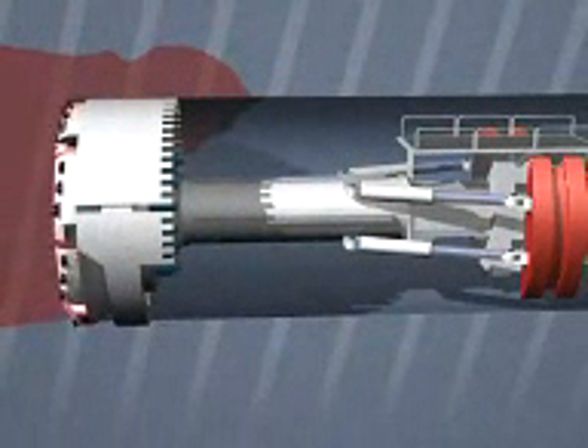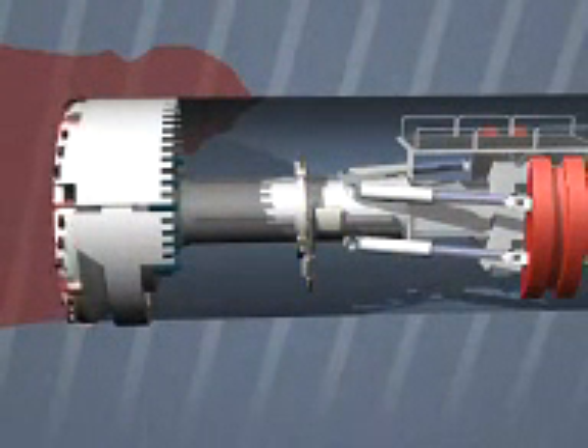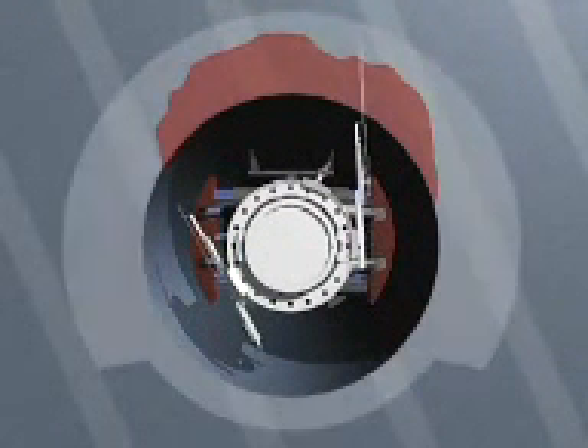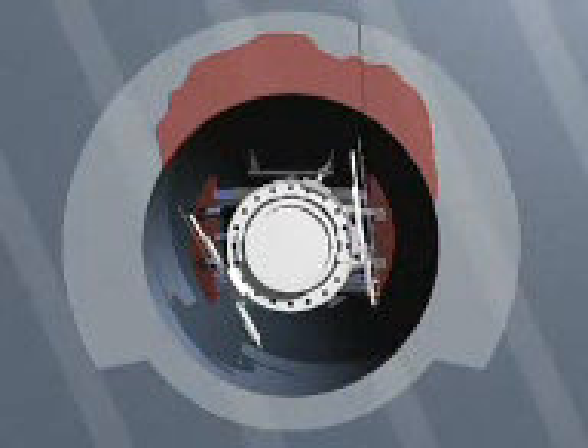While boring goes on, securing work is carried out under the protective roof immediately behind the cutting head. For example, two anchor drills with independently maneuverable drilling carriages are being used. They are drilling holes into the rock for anchors, which can be up to 4 meters long.